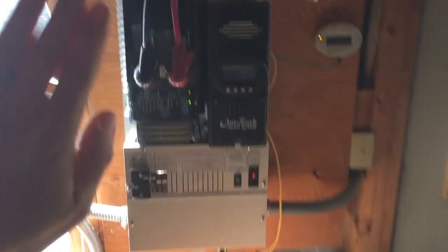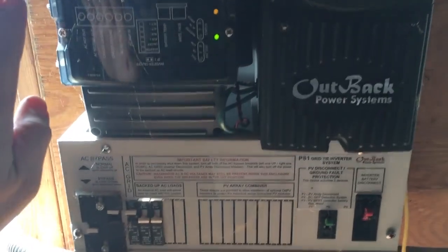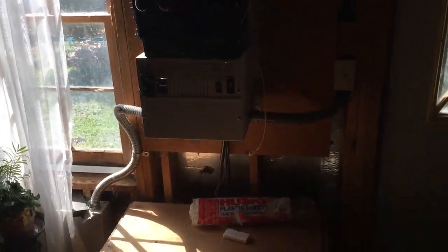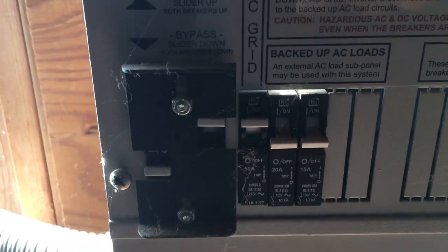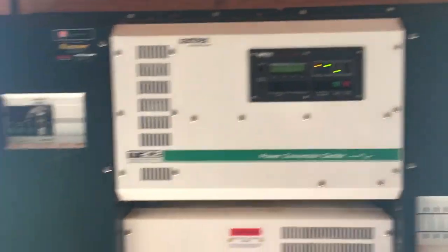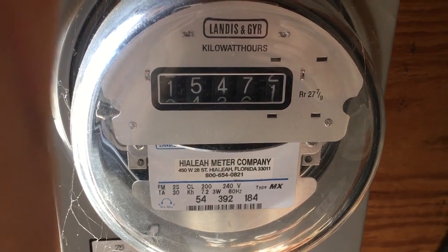This is the other system she has — it's just that pre-wired Outback. It's a 48 volt system too. Two 48 volt systems. Nice little battery systems, but these are just being used in a grid-tie application — you can see the output breakers are just off. Now you can hear those relays clicking and it's starting to sell some power to the grid. You got past that five minute waiting period — watch the old cool analog meter spin rather slowly, but spinning nonetheless.